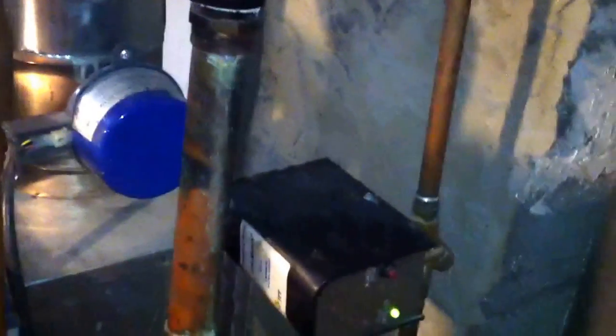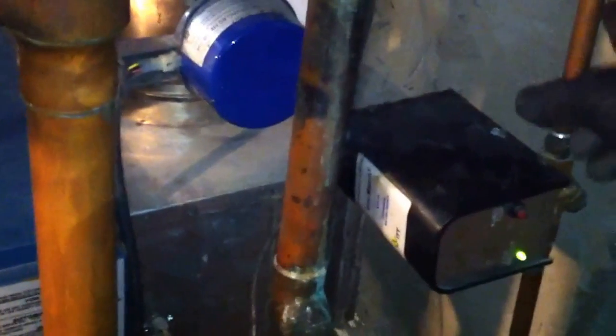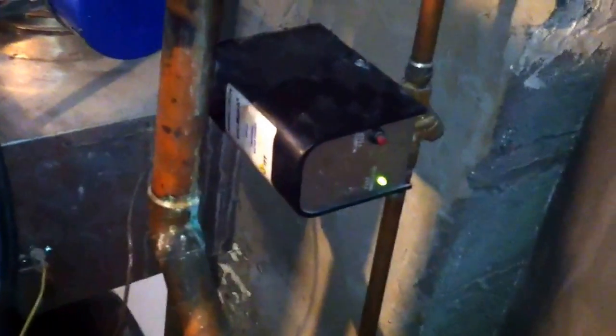If this had a bypass, the way I like to set up my boilers is put this in like this but also put a valve and a manual bypass where I can put water in by hand if this breaks — or in this situation I can add water quicker rather than relying on this to do maintenance. The way I like bypasses is because if these go bad, at least the person can add heat until I can get there to return.